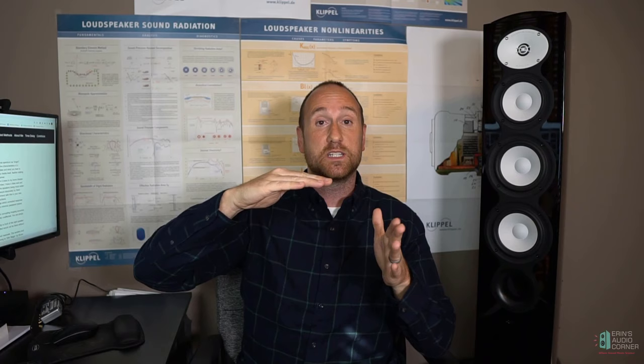Let's talk about dynamics. Dynamics is one of my favorite things in a speaker when the speaker does it well. First of all, a lot of audiophiles think that dynamics is just loudness. That is not the case. Dynamics is what happens when you're playing at a level, let's say you're playing at 85 dB, which is kind of typical for most people. And then all of a sudden in the music itself, there is a snare hit and it's plus 15 dB. When you have a very low dynamic system, you may only catch plus 6 dB of that snare hit.